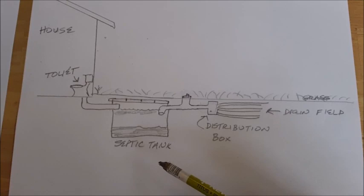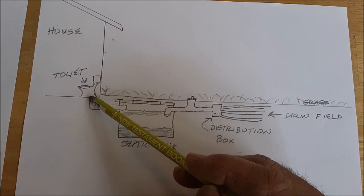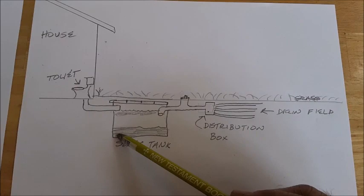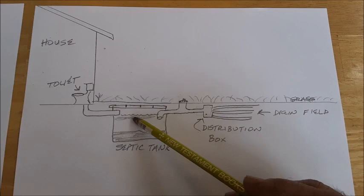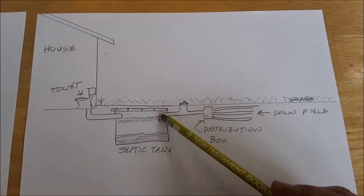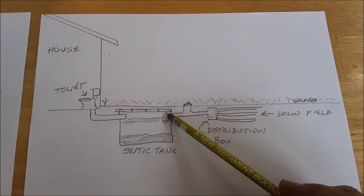I want to do a quick explanation of how a septic system works. Suppose this is your house — here's your toilet. There's a pipe that comes out of the bottom of your house and comes horizontally into a septic tank. The tank is mostly filled with water, with a little bit of sludge in the bottom being consumed by bacteria, and an airspace above a crusty layer on top of the water. The tank lid usually comes in sections. There'll be a pipe coming out — either a straight pipe, a T, or a curve down. I like the ones that have the curve down.